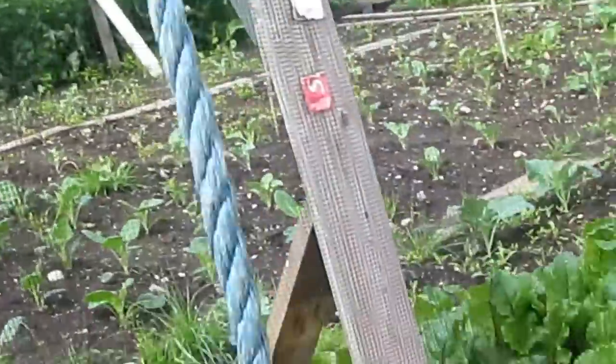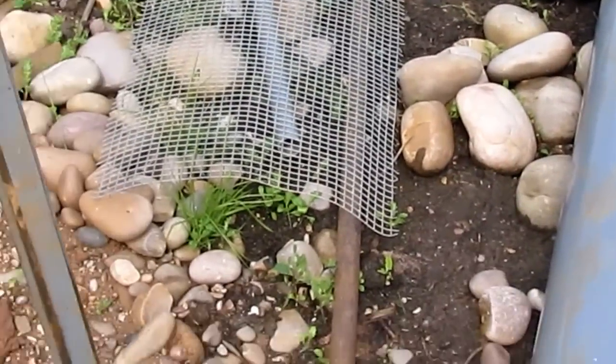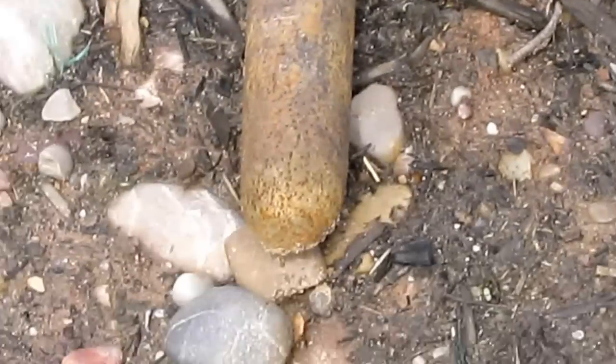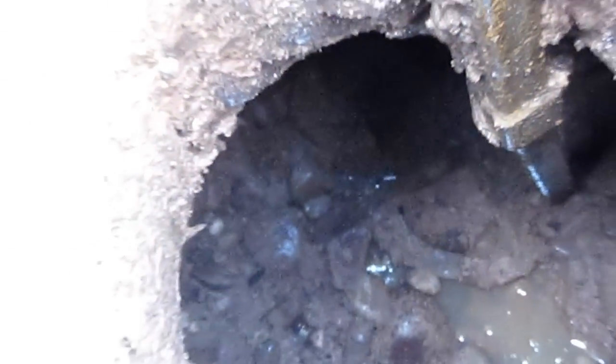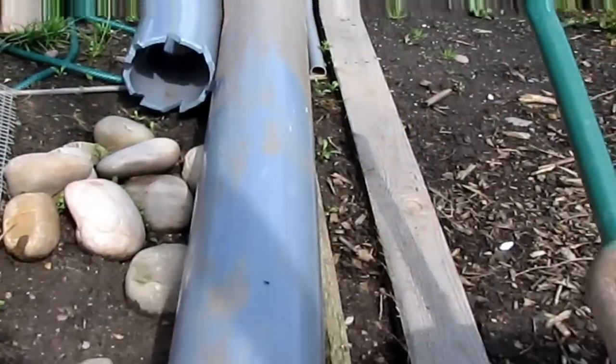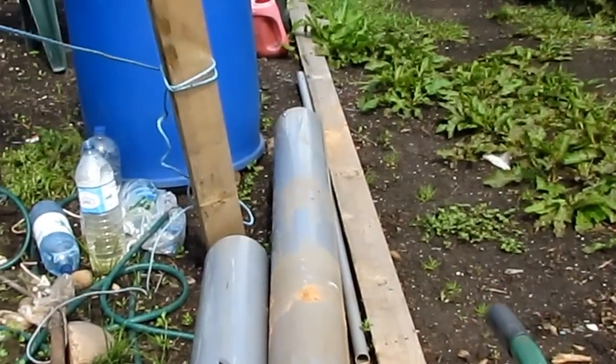There's the cage. There's some stones, big stones about out. We're presently about three metres deep down here, and we're working on getting the auger out. Because I left it in one night and there was a collapse. And there's a bed itself. So that's going to be part of the liner, eventually.